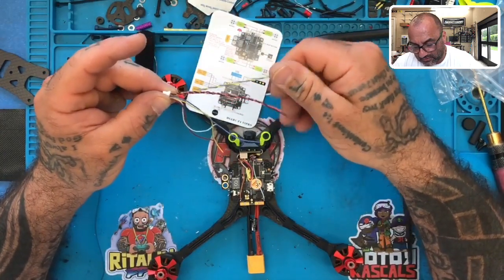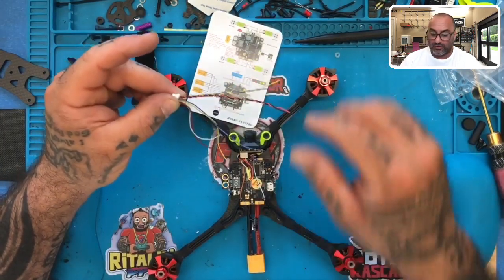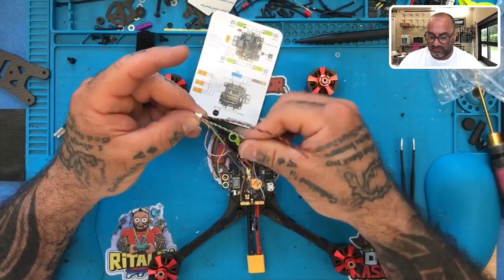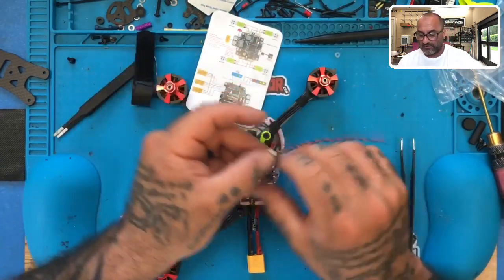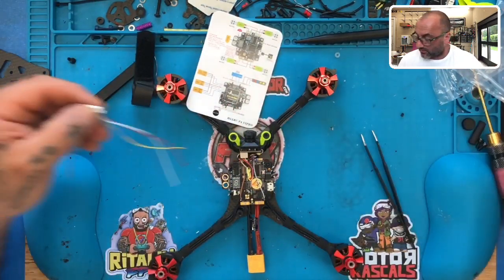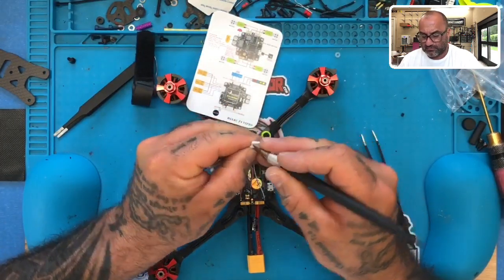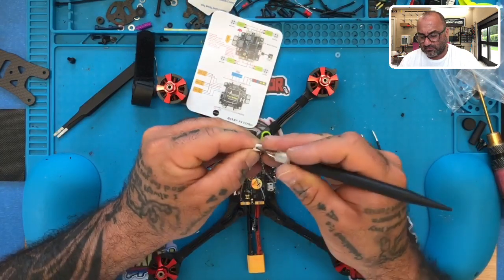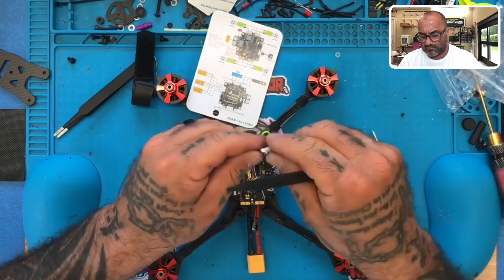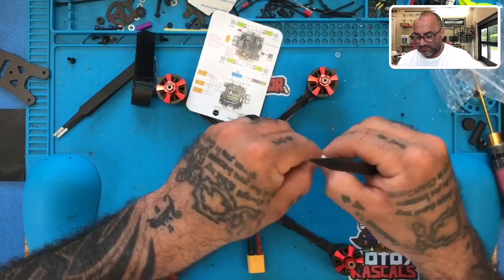But we don't have, oh, you know what? We've got 5-volt and ground right here on the board. So we'll use that for his. So what we can do now is pull out the rest of these, and we're going to use the back instead of using the side. So we're going to remove the side altogether, and we're going to remove all these from the back. So let's get my X-Acto knife. That should be it. Those are the four wires that we need out. Yep. Put those tabs back down.